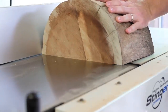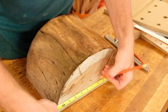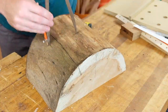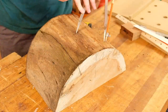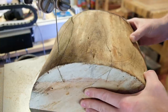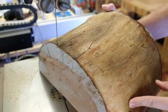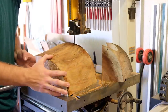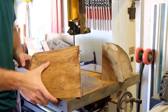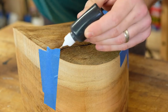I still got a fair amount of cracking anyway, but nothing too crazy. I marked the section I wanted to use and cut it up at the bandsaw, then I flattened the face at the jointer and marked out a circle that would be my bowl blank, which was around 8 inches in diameter. Then I went back to the bandsaw to cut it out. Next time I'll be more careful cutting this out because any deviations from your lines end up making things difficult when truing up the blank on the lathe. I filled some of the cracks with tinted epoxy.